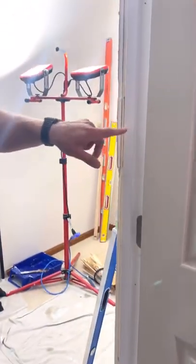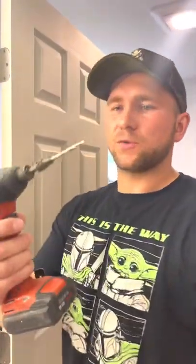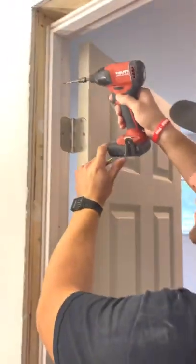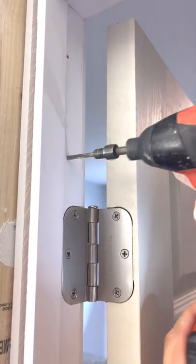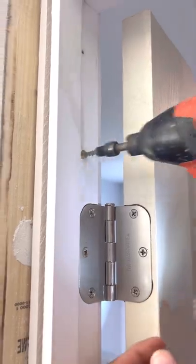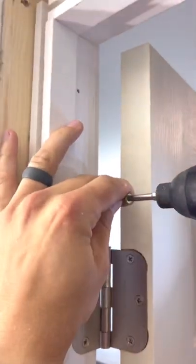Make sure that you're not nailing into this part because that's where the other side comes into, so you want to make sure that you don't have any visible nails in there. I like to add a couple of construction screws — two construction screws on the hinge side of the door. This is the side that gets the most stress. We're going to use a bit like this that recesses a little hole for the screw to go into. I'm going to do it near a hinge, and then add a construction screw into that spot, and it will make this entire side very strong.